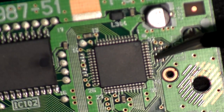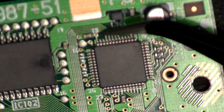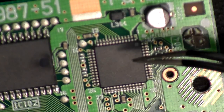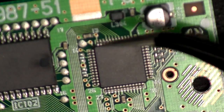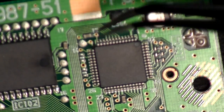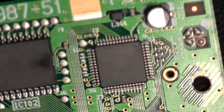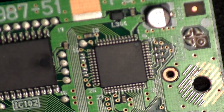If you don't feel comfortable soldering pin four to that via, you can certainly use the original diagram and solder pin four to where it's shown there — it will work perfectly fine. That point is all the way across the motherboard and uses a lot of wire, which is why I'm using the alternate via. To prep the two vias, I'll take a razor blade and slightly scrape them to get the solder mask off, just so I can solder to that little area.